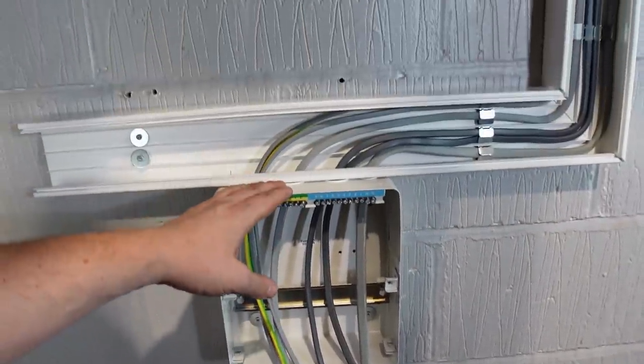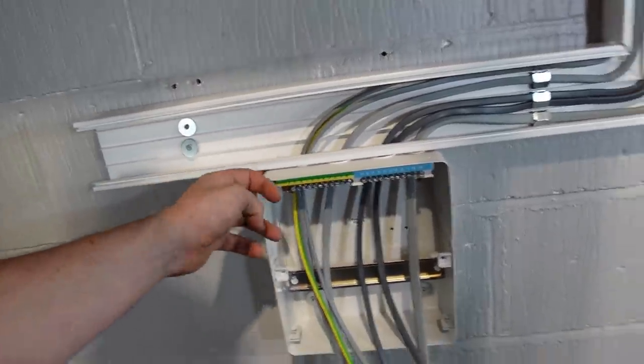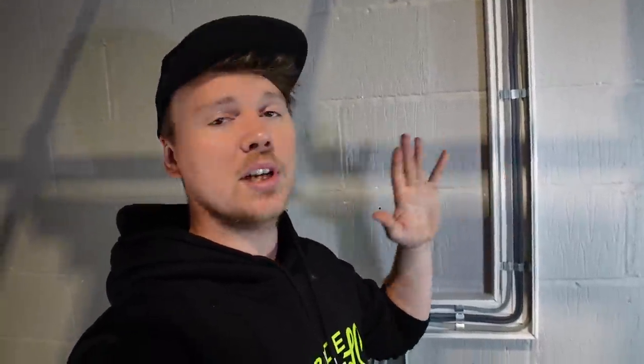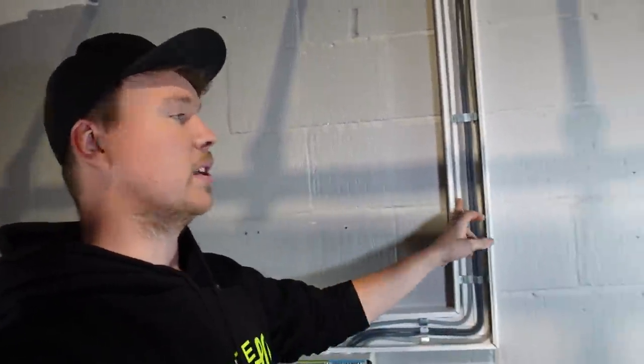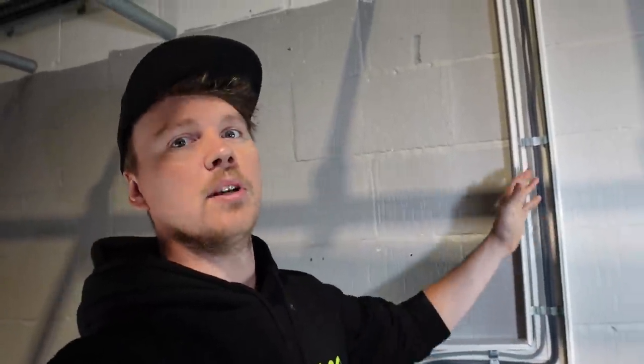So it's a bit of wiggling and messing around. We've got our cables out through the fire grommets. I will put some fire sealant around the top of the trunking as well, just to seal it in and make it look a bit nicer. It really is simple - just take your time with it. A lot of the time when we put trunking on, we'll put a bit of corking down the side here as well - just makes a bit of a finish. Obviously this is rare that it's going to be on brick, but normally it would be on plasterboard. Take your time, if you've got the time allowance, stage by stage - plan out your cables above. Figure out which side you want to bring the cables, the crossing over, the loops. What I've been thinking about doing is getting cable flags, and as we go through, we put some cable flags inside the trunking to identify 6mm, ring main, cooker, boiler, hob, shower - that sort of stuff to make it easier for the next guy. It's all about trying to preempt what might happen so we can easily identify and pull stuff out.